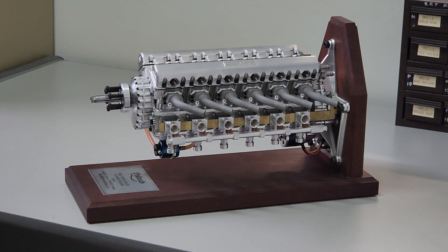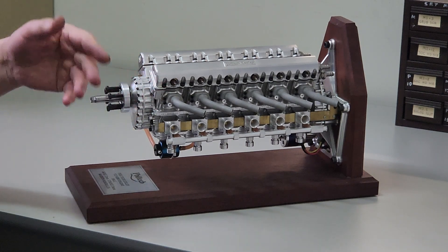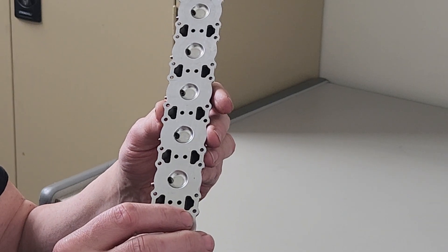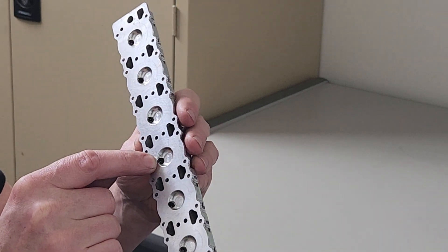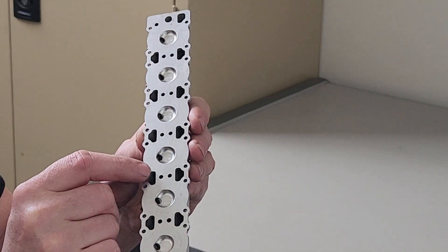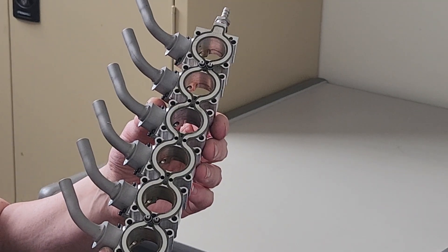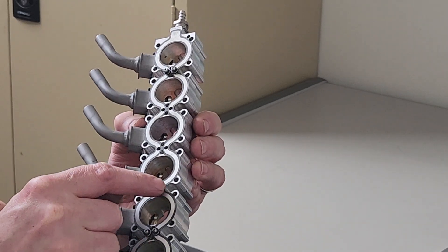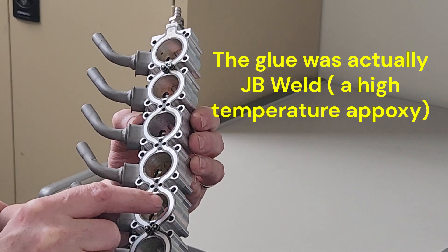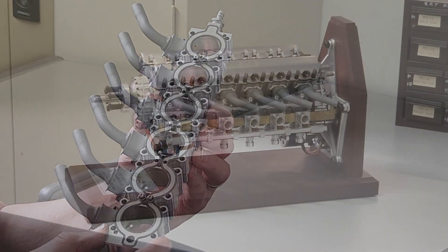When we gave it a test, it was a bit of a disaster. The one-piece cylinder head warped and leaked water. The angled glow plugs didn't ignite the combustion properly — the angled plug was a complete failure because it needs to be in the center of the hemisphere to ignite the fuel properly. The water pump wasn't powerful enough. The one-piece water jacket had cavities we tried sealing with glue, but that was problematic — it had little bubbles that sometimes broke away and leaked. It's definitely not the answer. It was back to the drawing board.